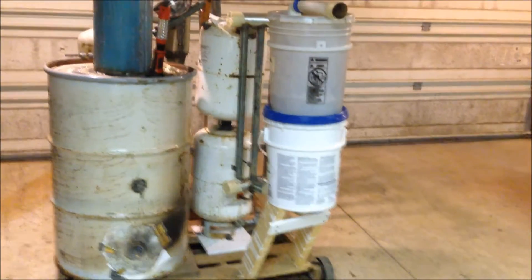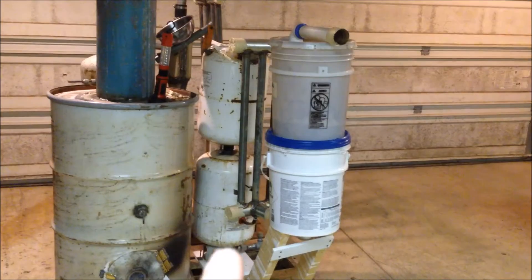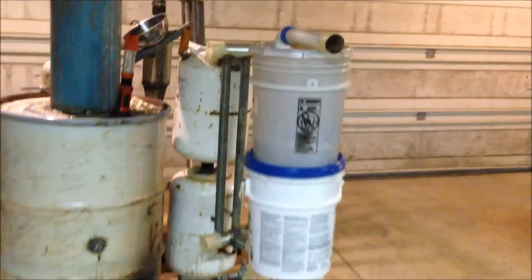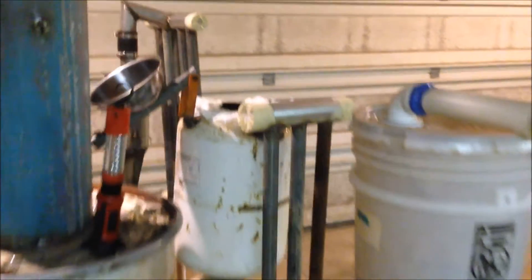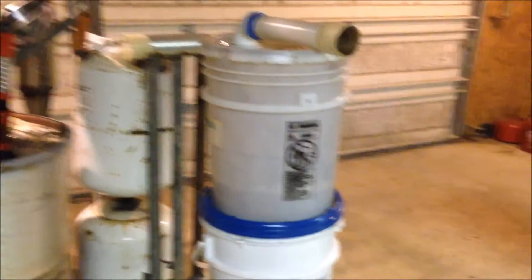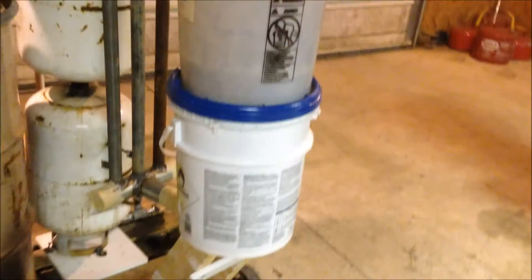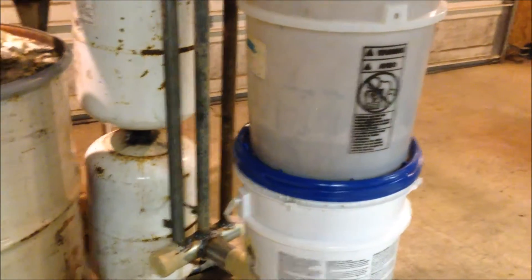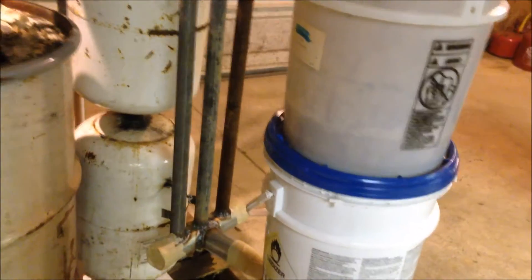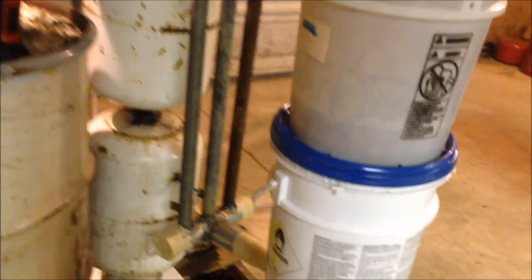What do I need to do? I need to cap off the ends of my radiator pipes with some sort of removable cap so I can get in there and clean them out. I need to seal up everything, make gaskets for these lids out of silicone. I'm also going to silicone up all my welds — even though I didn't find anywhere it was leaking — still going to seal them up for good measure.